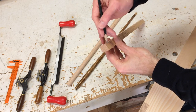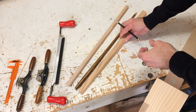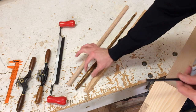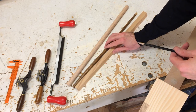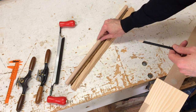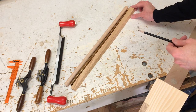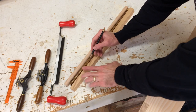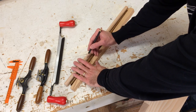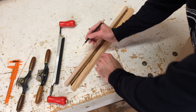So now I have a square piece of stock here. I'm going to work it down, but what I want to do first is mark out this section here to get a size on the width. So I'm just going to line up the dowel with the spindle and the square piece and mark out roughly where this widens out. About here